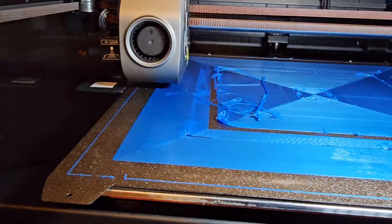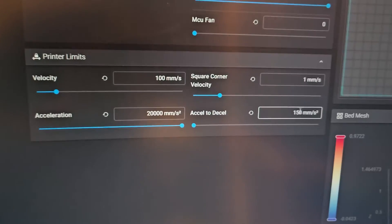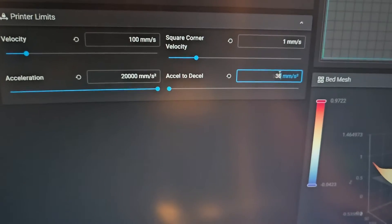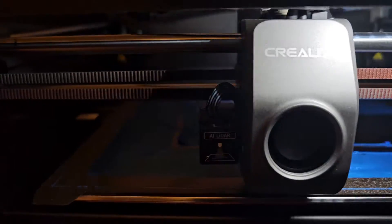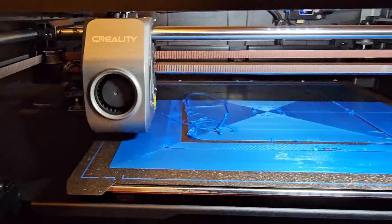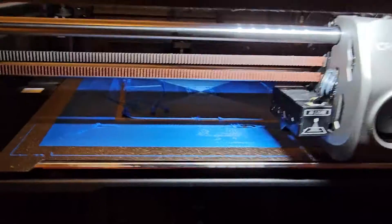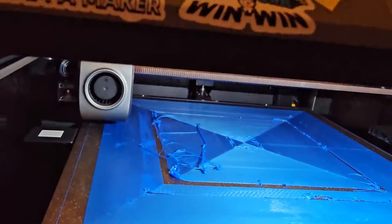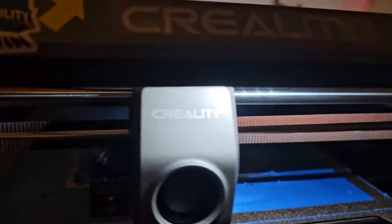It's moving a lot faster now, and you can kind of hear it starting to get those weird artifacts again. Let me increase acceleration to 300 and see what happens. I think the reason is that velocity is too low — let me put it to 200. There we go, it moves faster now. So velocity matters together with the acceleration/deceleration setting.